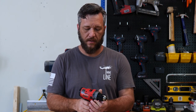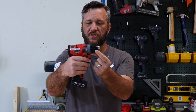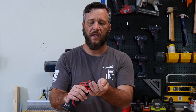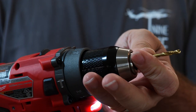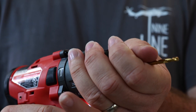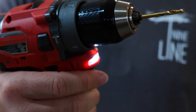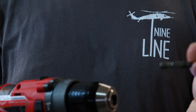Drills also generally have a clutch. They all have a chuck — the chuck is the part that holds your bit in. These are keyless chucks. Pretty much all new drills are keyless chucks, other than really heavy duty drills. The way you put your drill bit in: take your bit, put it in the end, loosely grab around the chuck, and then in your forward function on your drill, squeeze, and the teeth will close around the bit as it tightens. To take your bit out, put it in reverse, squeeze it, and then take it out.